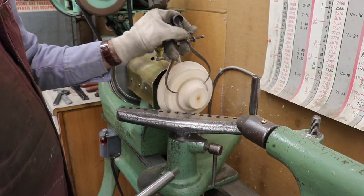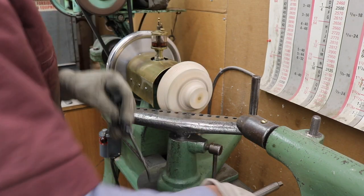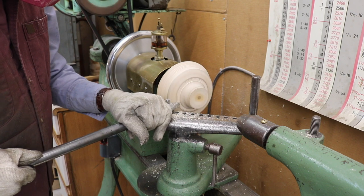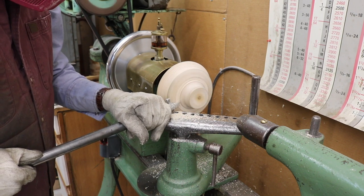Well, now that I have the chucks that I need, I'll go ahead and turn them down to the shapes that I need, and I'll spin the shells over them that I need to complete these tails. I've already used this chuck for two parts in the heads of these lamps, which I'll show you in the next video. For now, I'm going to concentrate on the spinnings that I need for the tails.